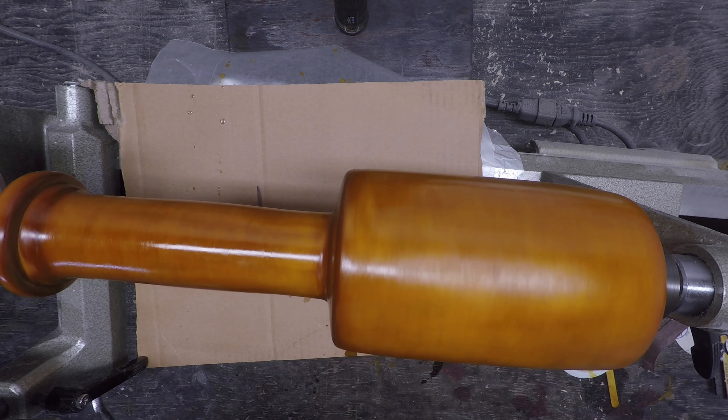I really did it more for the coloring. I'm hoping that that concept ends up translating for somebody that's going to be looking for more of kind of like an antique or just a yellow stain that's got a really nice coloring to it. I really wish that the camera could really capture the depth and just the real beauty that this thing ended up having for the color and the finish. It just really ends up having such a beautiful depth — you can see some of it right there. It's an amazing finish, even though it's got the misruns and all of that other stuff. It's the first time I've ever worked with the flowering crab wood, and the dyes did a really good job adding a really nice depth to it.